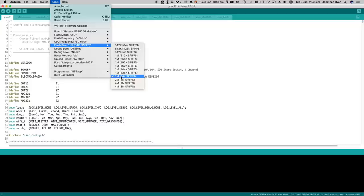But it gets even worse than that. If you use SPIFFS — which is an SPI Flash File System — to store non-volatile data, that takes away part of the memory as well. It's fairly normal to configure say a one megabyte memory with 64k SPIFFS. So by the time you divide by eight to get megabytes, then divide by two for OTA, then subtract the space required for the SPIFFS, you're not really left with a whole lot. So one of the things you can do is replace the flash memory chip on the board to give yourself a storage upgrade.